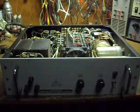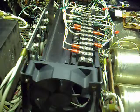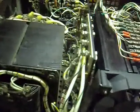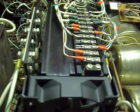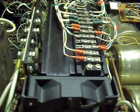Here's an old Trigon power supply that I just rebuilt, upgraded it to a degree. It was made back in the day when germanium transistors were the mainstay, although it does have silicon rectifiers in the rectifier assembly. The original TO3 transistors were germanium, and because of that, I had a relatively large fan cooling them, a continuous AC fan, relatively limited output, all based on the size. It did have 15 amps output at a maximum of 15 volts.